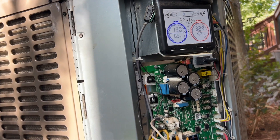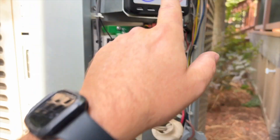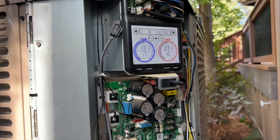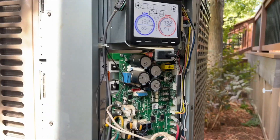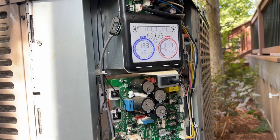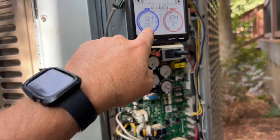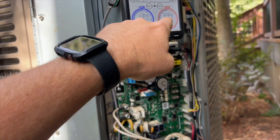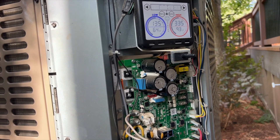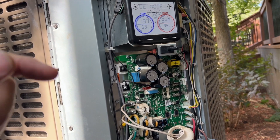She's been running for a little while and everything seems to be pretty good. I'm definitely not getting a low suction. Pressures are slightly different — so either I'm out of calibration or the unit's out of calibration, but it's still pretty close. The high side seems to be off by about 13 PSI over, and the suction is about two degrees under. This is the newer sensor, so maybe that one's out of calibration. Other than that, it seems to be okay — I think we're going to call it good. I'm going to go ahead and cycle this from the thermostat and make sure that error code doesn't pop up again.